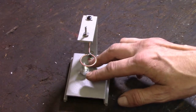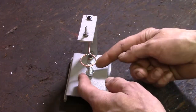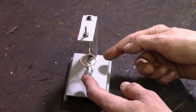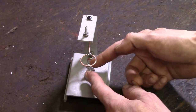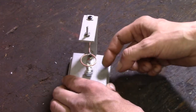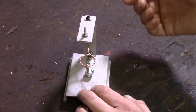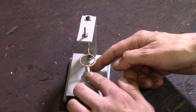Another thing you could do is, instead of having the copper ring, you could use a piece of tubing — as long as it was electrically conductive. Then you have your weight at the bottom, and so when it tilts, the weight will contact the side of the tube and that'll complete your circuit. Just make sure everything is electrically conductive.